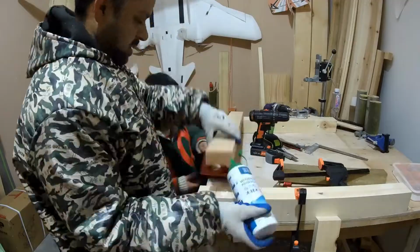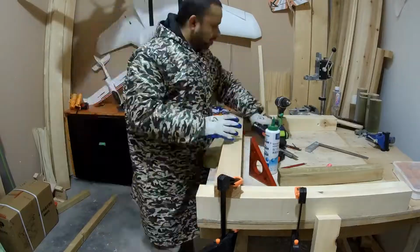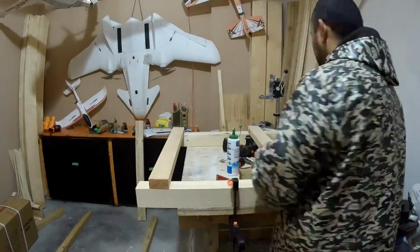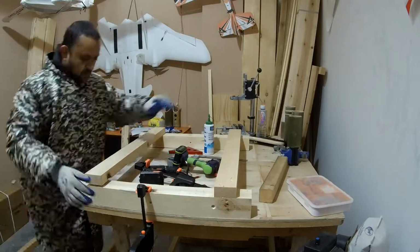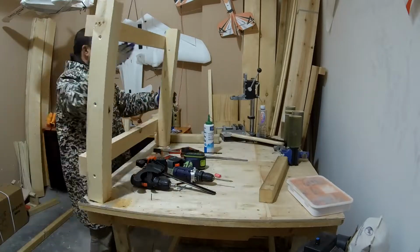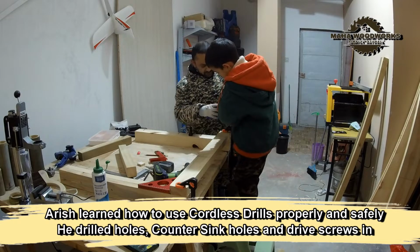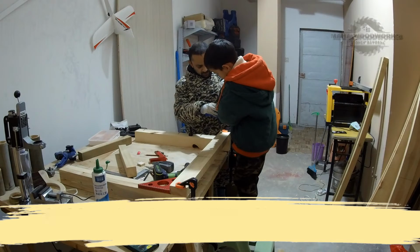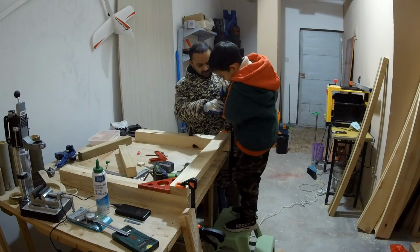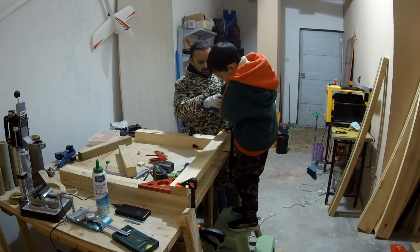One side of the leg frame was easy to make by using wood glue and 2 or 3 screws. The red triangle that I'm using, I got it off Banggood. It's a very nice heavy piece of metal and does a very nice job to square things up. Very helpful. I also got a smaller version. The L-shaped red marker ruler is also very helpful here. You put it right here and make sure it's straight like this. Now push more, and put it down. Okay? One hole. Go down. More. Awesome. Good.